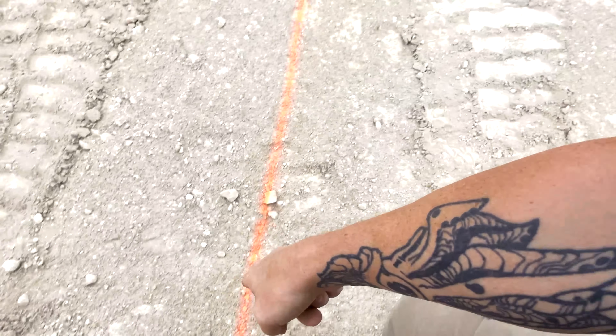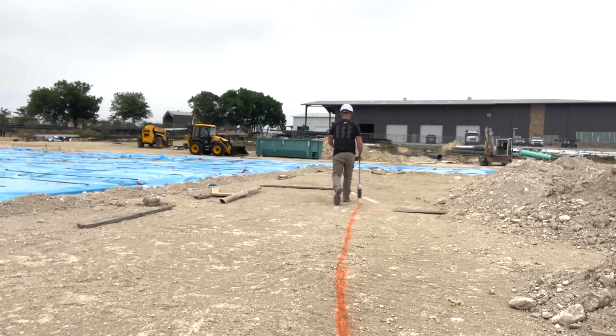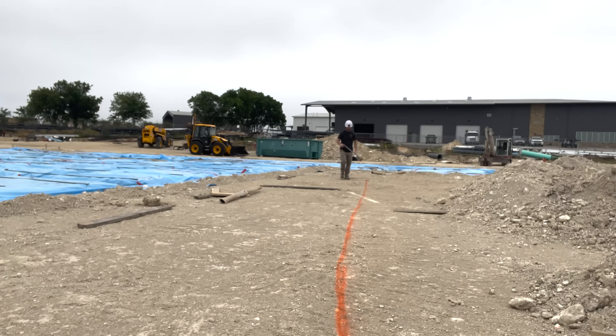Today I drew this little line — you can kind of see it. I walked along and drew this orange line that I've got to follow. It's kind of cattywampus; I'm not actually going to make it all crooked like that, but I have to clear a path all the way over there. I've got to get it two feet deep — well, two feet to the top of my conduit. Typically I just go 36 inches deep so that any backfill or anything that spills into the trench while I'm digging, I don't have to re-dig it all out. I just lay my conduit and I know I'm 24 inches to the top of that conduit.